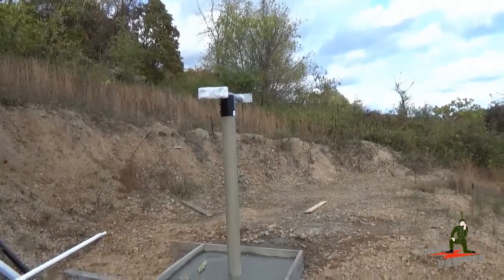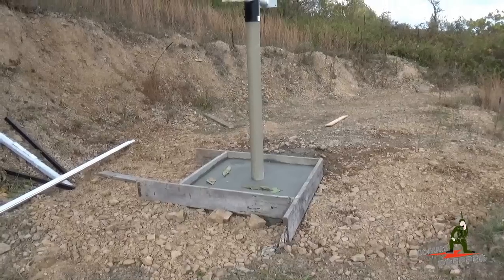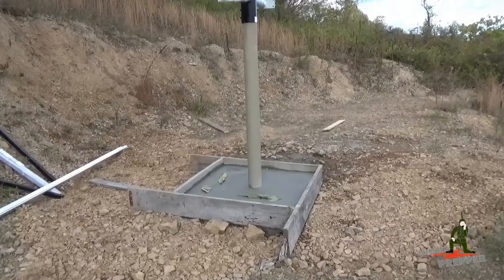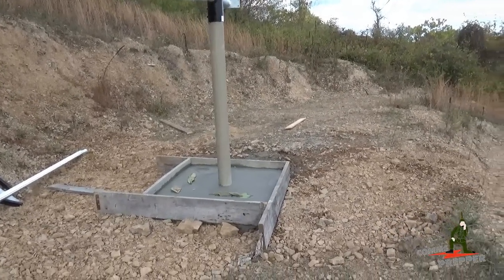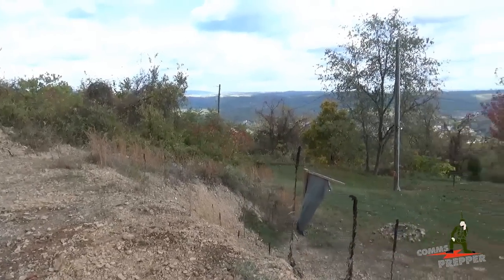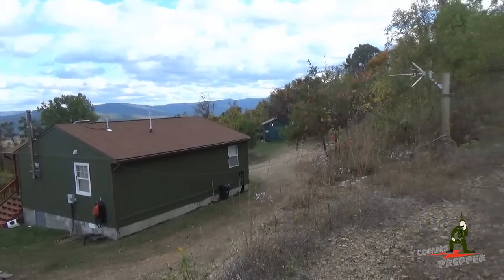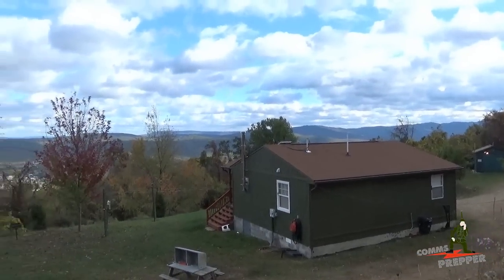The ultimate goal is to relocate everything up here to this location — the batteries, charge controller, and inverters — and then have a trench with conduit feeding the AC voltage down to the house. This should allow me to keep my DC runs very short, save money, and make the system more efficient. From this location above the retreat, I've got a pretty good look angle east and working my way south. In the summer and winter months, I'll be able to change the look angle of the array as well, as opposed to my fixed array that's currently on the roof of the retreat.